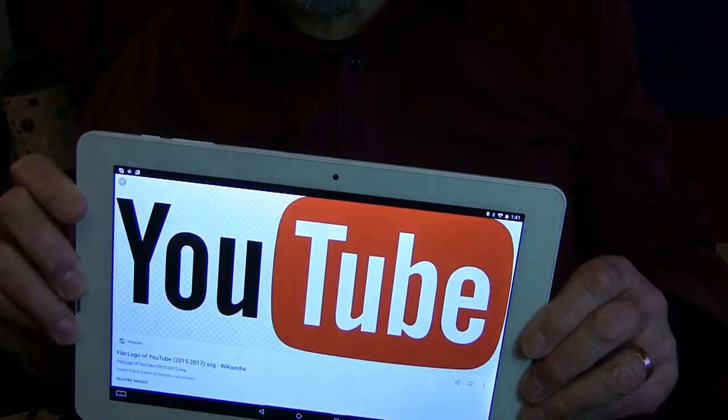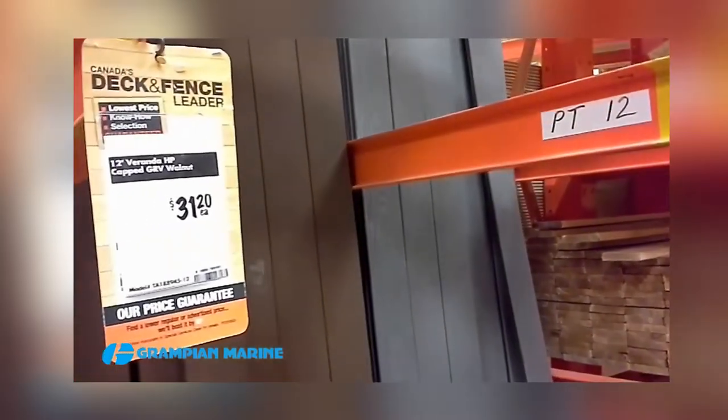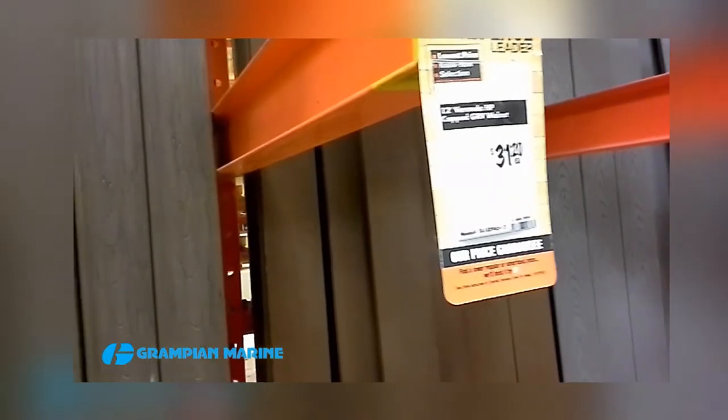If your boat is tarped, winter is also a great time to replace your hatchboards. You've probably seen this new wood. Well, it's actually not wood at all, it's plastic. Recycled polyvinyl chloride. It won't rot, it doesn't require any maintenance, it cuts and shapes easier than wood, and it kind of looks like wood. A little bit, yeah. At any rate, it won't rot.